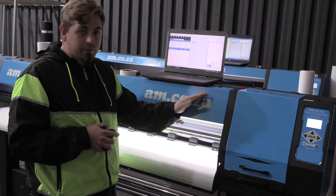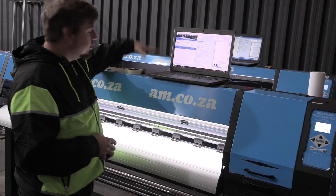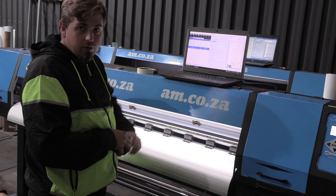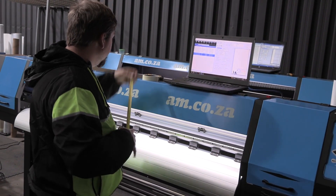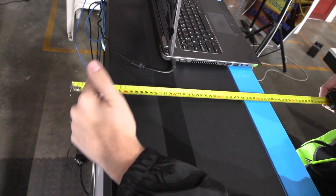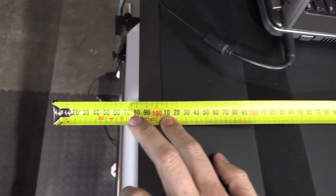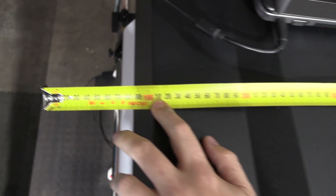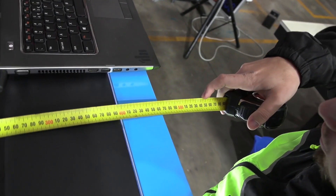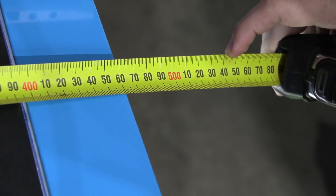For me, I would prefer to have it a little bit higher, simply because if water runs down it will go further down and not damage the main components of my machine. So we need to make sure we've got a top piece, a front piece, and a back piece. Go ahead and measure the top — keeping in mind we've got cables on that side we don't want to pinch, so I'm going to leave 100mm on each side, giving us 540 as our top piece.